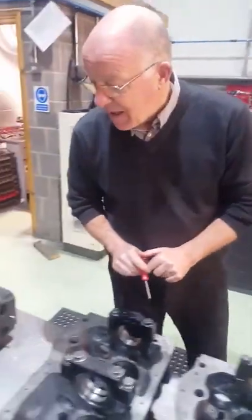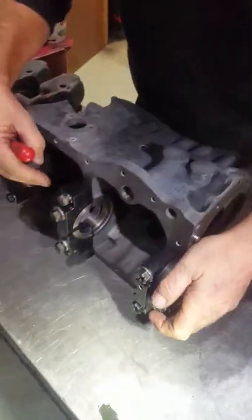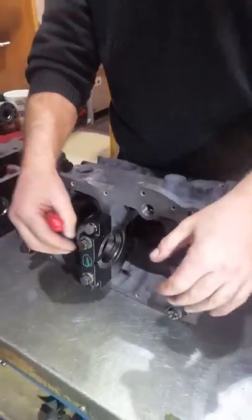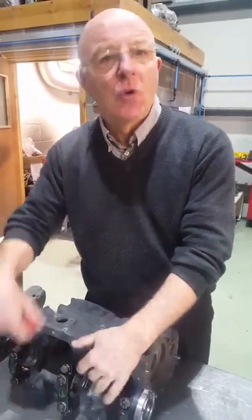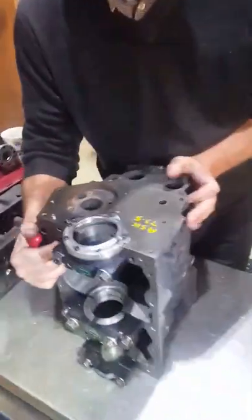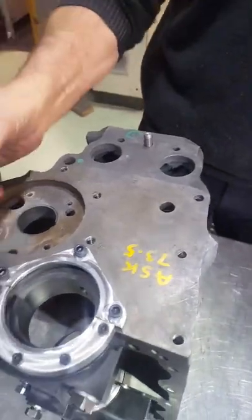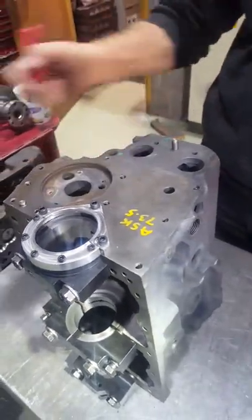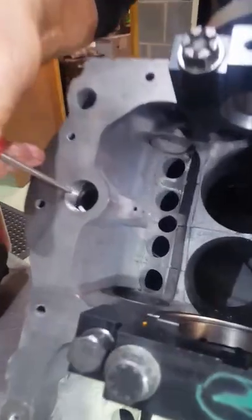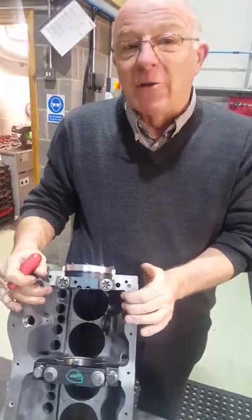This is a converted mini block — still the same part number, 12G 1279. This one's got steel caps on, just bolted on here as slave bolts for when we line bore, so we're not torquing up and re-torquing studs. This has got brand new dowels fitted here and here. So we've put this on the milling machine, dialed in where the holes go, drilled them, reamed them, made and fitted the dowels. We've also drilled one, two, three, four extra holes, and drilled and tapped the oil pickup hole, and drilled and tapped there and there for the sump. Four or five hours' work at least.